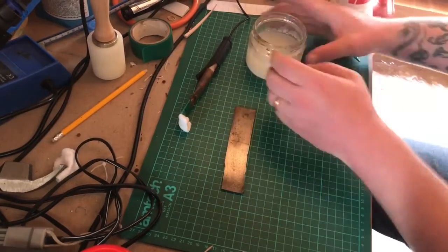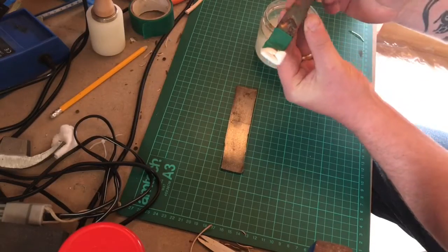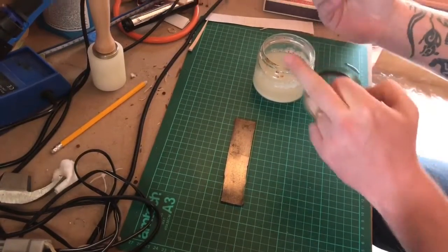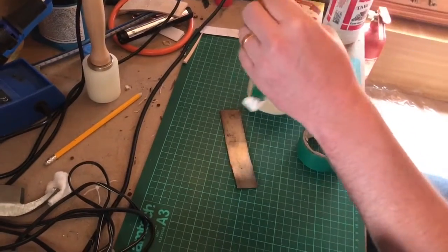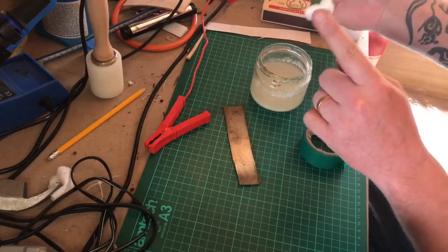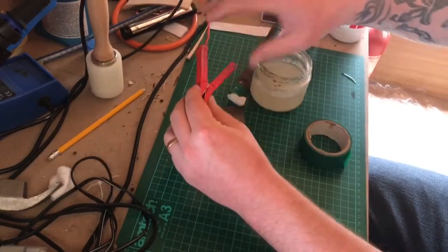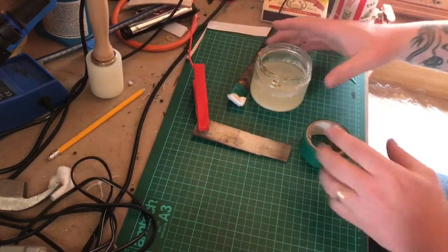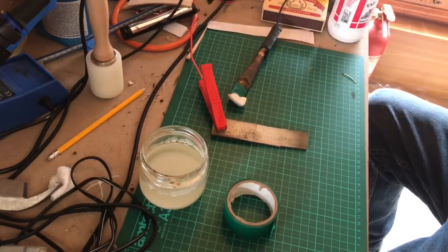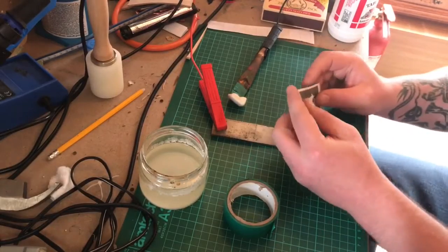So we've got the saltwater. This connector I just showed you is a piece of copper — I've taped it on with standard insulation tape just to stop it from falling off. This makes the contact between the metal and the other probe. If you're getting sparks you're doing it wrong — no metal should be touching metal, it should be going through the water onto your metal. Your positive goes on one side of your metal. It's important to clean your metal with meths to make sure it's clean and grease-free from fingerprints, as that can stop things working.